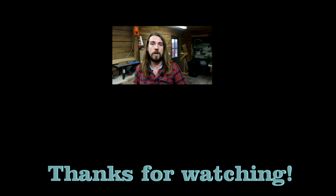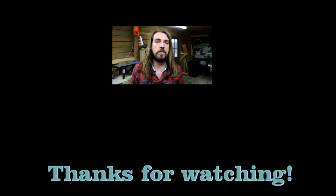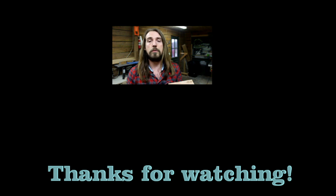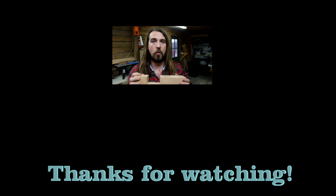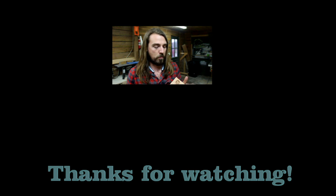Also, a quick disclaimer while the credits are going and the thank you for watching and the other playlists are coming up, I do want to tell you guys that it is ill-advised to ever use solid 4x4s for your table legs. It's gonna crack, it's gonna split, it's terrible. You do not want to use solid 4x4 blocks if you don't want giant cracks developing in the next 3-4 years as it dries. Really what I do is take two 2x4s and laminate them together and then cut my stock from there, and that way if they ever cup or warp, they're gonna be cupping towards each other. It gives it a little more strength, a little more sturdiness, and it's much less prone to checking and cracking than a solid 4x4 is. So take that, put it in your pocket, that one's free.